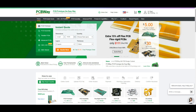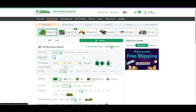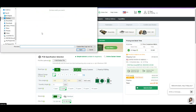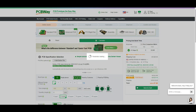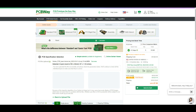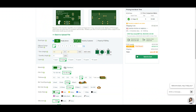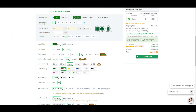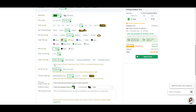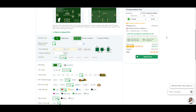Getting your boards made by PCBWay is as simple as a couple of mouse clicks. Click on Instant Quote, then click on Quick Order, and add your Gerber file. The Gerber gets loaded — sometimes it'll draw you a picture, sometimes it has trouble. Today we get a picture, good. Five boards is fine, two layers. We're making these ones red, and for the most basic order the only other thing you need to check is this little check mark, then choose your shipping.